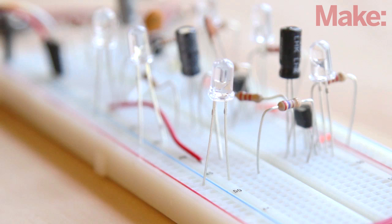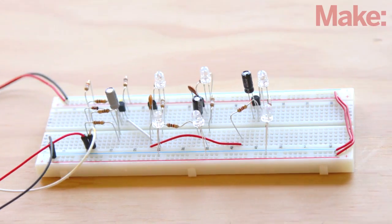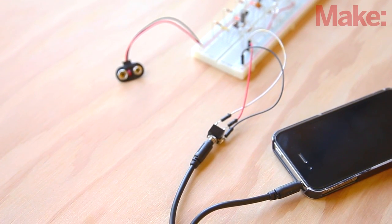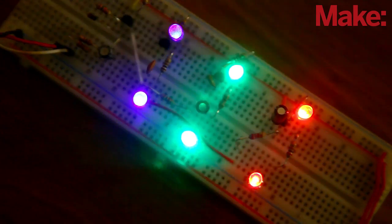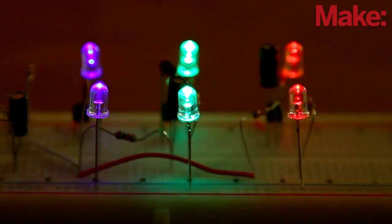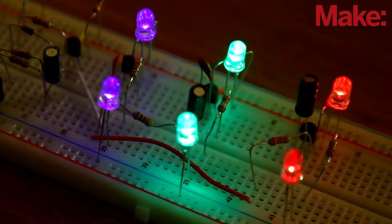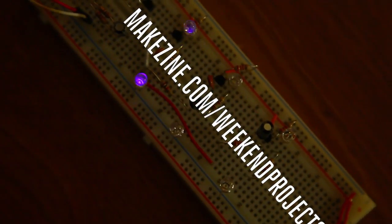Connect the second red LED with its positive leg to the 270-ohm resistor and its negative leg to ground. And that's it! Plug one of the male ends of the audio splitter into the audio jack of the color organ and plug the other male end into your music player. Now plug your speakers or headphones into the female end of the splitter, plug in the battery and start pumping the tunes. The LED color organ listens to your music and splits it into three frequency ranges using the filters you just built. The red LEDs will flash in time with the bass frequencies, the green LEDs will flash to the middle range, and the blue LEDs will flash to the high treble notes. One good test is to play bass-heavy music and see how well your LED color organ shakes its booty. We'd love to hear your experiences — share your build notes, photos, and mods with us at the project page.